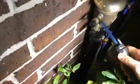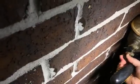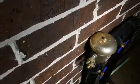Put this back — it doesn't close all the way — then go back to my backflow preventer. I need to get a screwdriver. Here are my two cocks — take off the protector caps. Now I'm gonna start bleeding this out. Get out of the shooting path of the water.